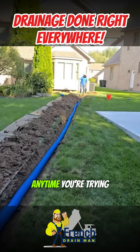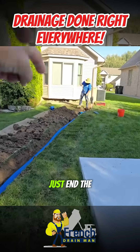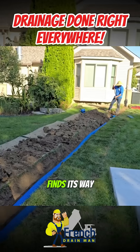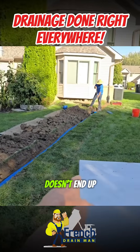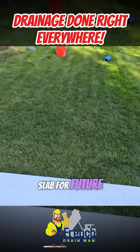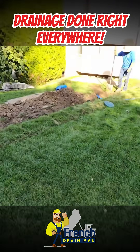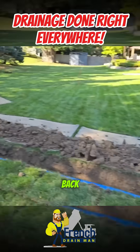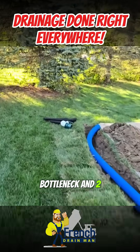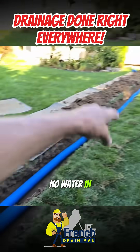Keep in mind, anytime you're trying to ask water to come through a bottleneck, you're going to have problems. If you just ended the pop-up here and hoped that the water finds its way through — if it doesn't get past this slab (this is a slab for a future building) — this area would end up with a lot of water. By taking this run all the way to the back, we accomplish two things: one, we get the water through that bottleneck, and two, we have so much fall that we leave no water in the line upstream.